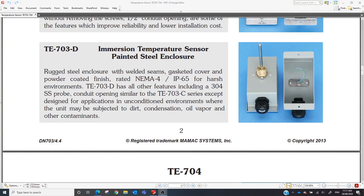So when you read IP 54 or 65 or 66, that gives you an idea of what the front number means and what the second number means — dust protection and water protection. Now if we look here, I've got a data sheet of a MAMIC pipe temperature sensor. It's a pretty good sensor — powder coated steel — and it's an IP65 enclosure.